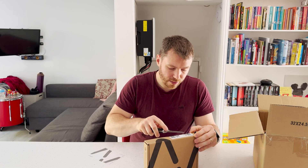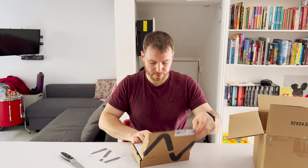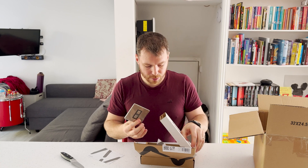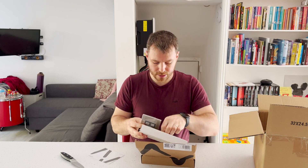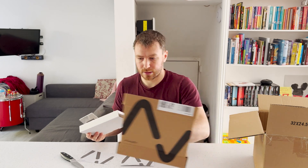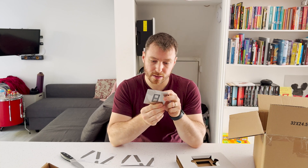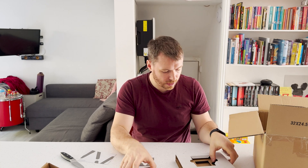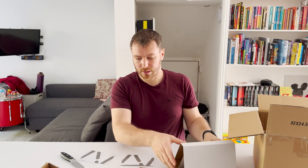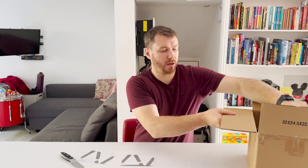What we have here is another smart dimmer — same packaging, all cardboard, a couple of screws. Single gang. Live and neutral in, switch line out, and the standoff spacer that goes behind it.